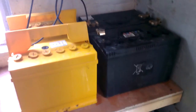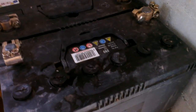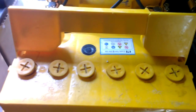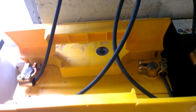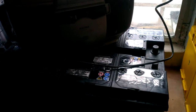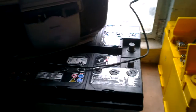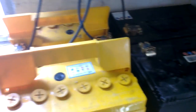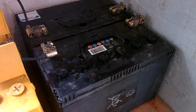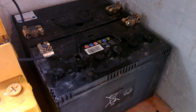I've also got to do some more jobs on these as well. These have currently got a new electrolyte in — a magnesium sulphate electrolyte — just to clear them up really and get them back up to speed, to restore them. These ones I need to check the water level in, and these can go on as well. These need to have the original electrolyte put back in — sulfuric acid. Anyway, thanks for watching.